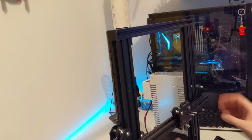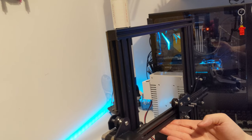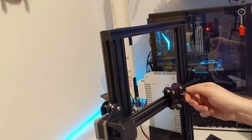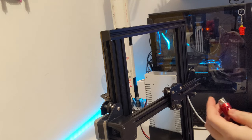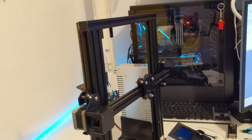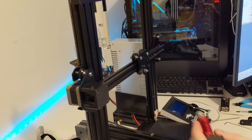With all of them set, I'm going to move this back up out of the way. It makes more sense to get the hot end attached so we can run the wiring into the cable chain and get it all closed up before we put the bed back on. With this hot end, it does come with Capricorn tubing which we're not going to use. We'll do Luke's hot end mod while we have it open - let's remove the Bowden tube coupler.